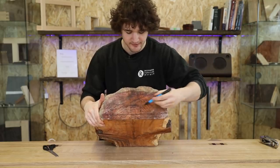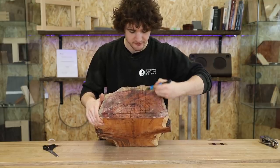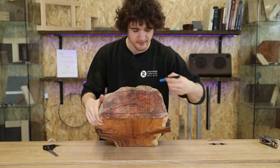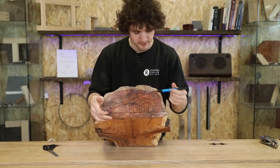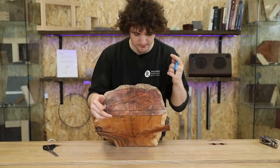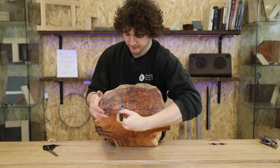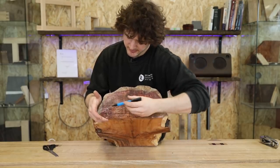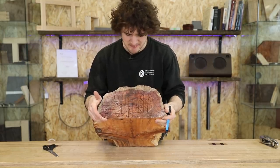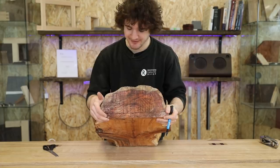So all of this here. And then after that, we'll quarter saw all these ones up from here. They're going to start going to rift sawn pieces here where the grain's going diagonal, and then if I carry on sawing them here, the grain is going to start going down more, and that might give me some pretty cool patterns on the faces here, but I think quarter sawn is probably going to be the way to go. So what I'll actually do is do some cuts up like this, and then I'll start doing cuts like this. Yeah, I guess I'll do something like that, maybe. Oh, actually no, that could be a nice rift sawn piece there. I could just make a square of it. I have no idea what I'm doing.